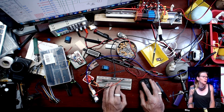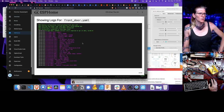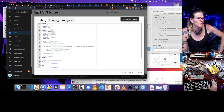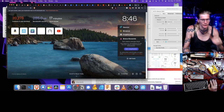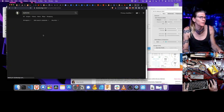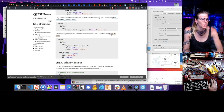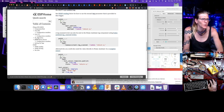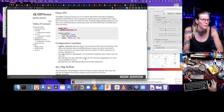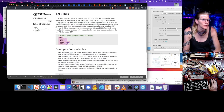This has got power, and let Home Assistant... okay, I'm probably going to be in Home Assistant here. He is beautiful. Connecting to, okay, block that off. Okay, let's go to ESPHome, we had it open there. I need I2C bus, I need PN532, send, okay. So this is going to be that. Let's get our settings set up. I need to manually specify the I2C ID. I don't even need that. I2C ID through bus A.